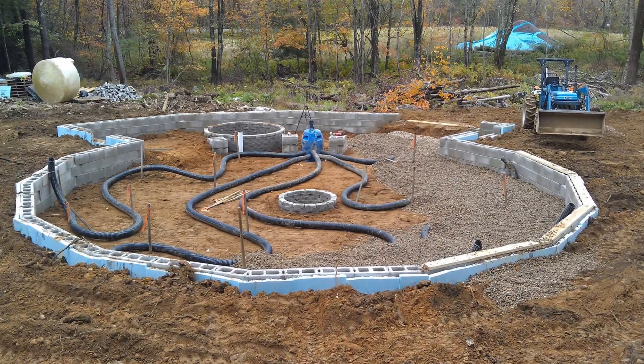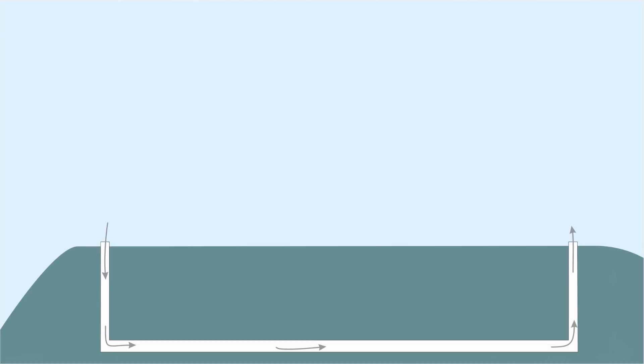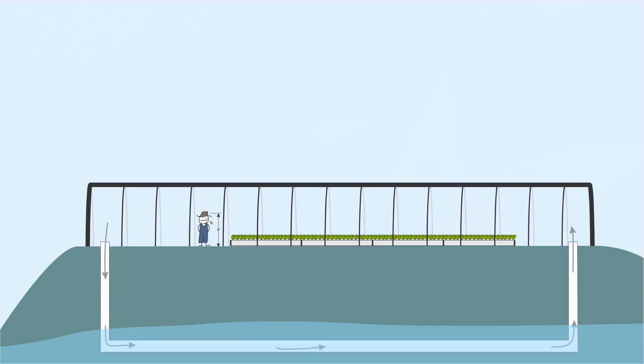I've also received several questions about a few things from the last videos. First, a lot of people have asked how come I didn't put in any thermal battery in this one like I did with the geodesic dome. I had looked into having the floor dug out, but it's such a large area it was going to cost just about $9,000 just for the site work to remove that much material. Plus, going down the normal 8 feet that we need, it's going to be below the water table, so I couldn't just put air down through here. The system would have to have some type of PEX tubing with water and then deal with heat exchangers and whatnot, so it just wasn't a good economical decision to use this floor space as a thermal battery.